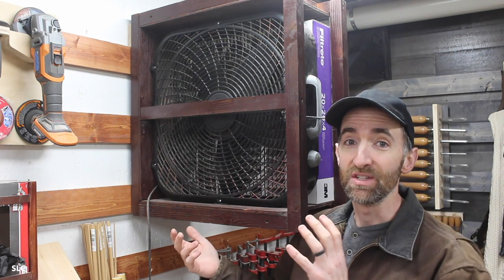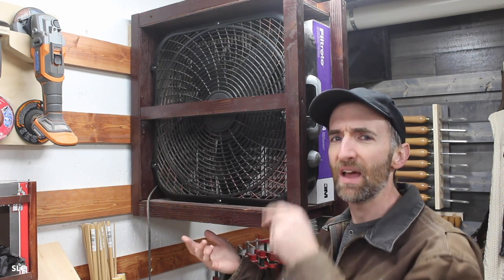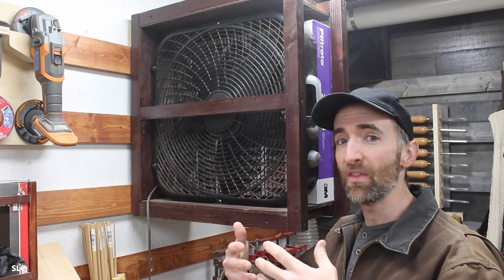Having an air filtration system is a great way to prevent breathing in all the dust particles or whatever else may be floating around in your shop. This is a home-built oversized unit, and I just have a French cleat holding it to the wall — I actually built this in a previous video, link in the description below. Any kind of air filtration system will work. Just put a nice cleat on the back and make sure it fits in a good position. Usually good to have it a little higher up so it catches particles floating in the air, not the ones that fall to the ground.